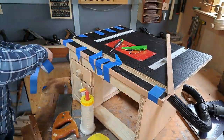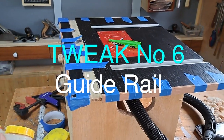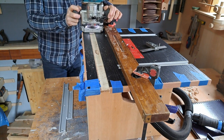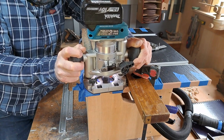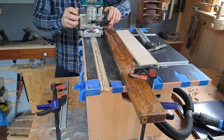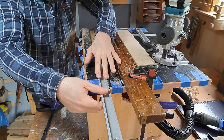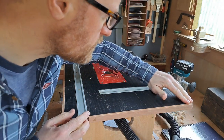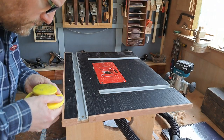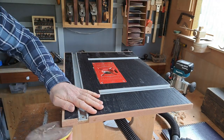If you saw the first video, you'll see that I actually made my own miter gauge that runs in the trench across the front. That didn't work well enough for what I wanted, so I just had to sink in a piece of T-Track — matches the ones I use for the fence at the back. I had to widen the gap, which I just did with the plunge base on my router: made it a bit wider, made it a bit deeper, and then the T-Track fit in there absolutely perfectly. Then I admired the edges once I'd taken off the blue tape and gave them a little sand — careful of the vinyl veneer, because it will rip really, really easily.